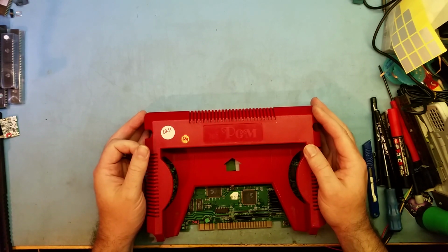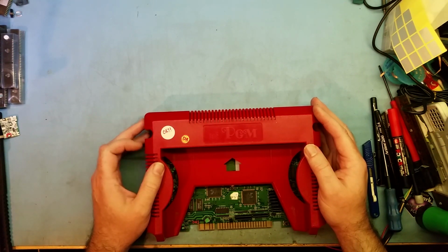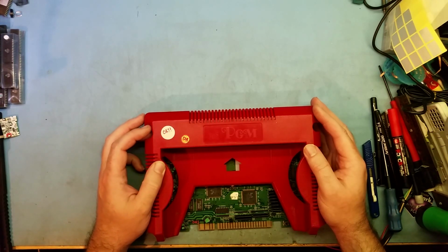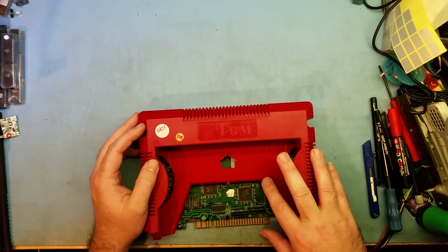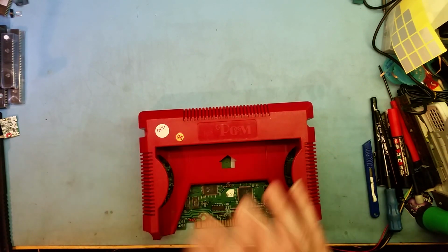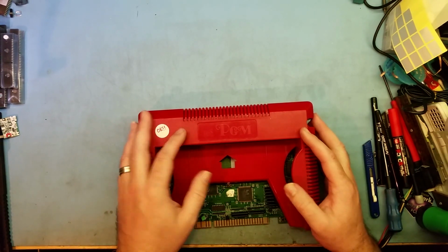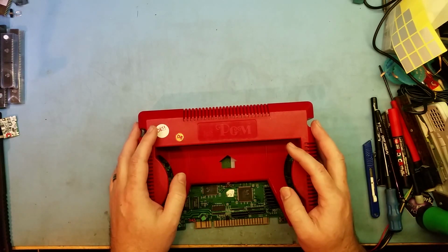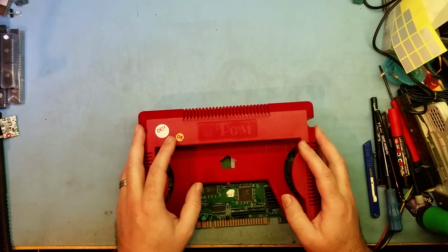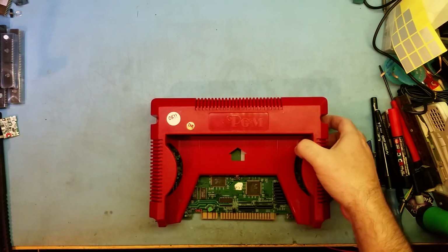They will leak. So it's just as bad as what you went through before with the NiCad, the nickel metal hydride leaking batteries. So if you get one and it's just got a holder on it, and there's no protection diode, then you really need to just leave the battery off. The motherboards work fine without batteries. Okay, you don't need to have a battery on there. It doesn't stop the board from running at all. Just cut it off, desolder it, just get rid of it. That way you don't have to worry. Okay, so there's the Rev 9.